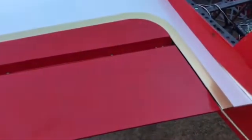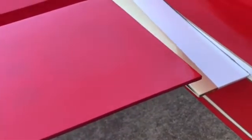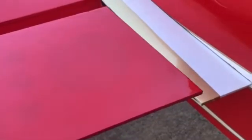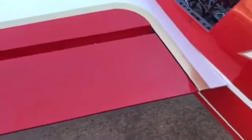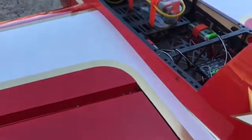I've put brand new 8944s in the aileron servos on these things, and I'll give you an idea of the speed and the resolution on them. As I'm slowly moving the stick, I've got expo in this particular flight mode — I didn't have to change anything on the airplane. It's very smooth throughout the transition, both servos working together. And as far as the speed — as you can see, it's very, very fast. Can't wait to get this thing in the air, try these new servos and see how everything works.